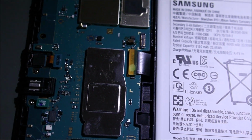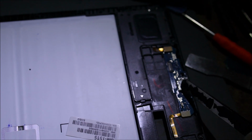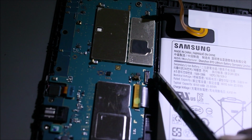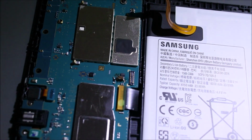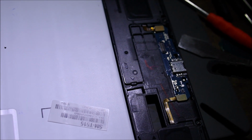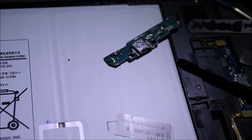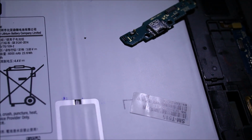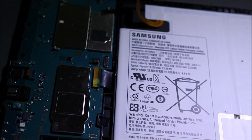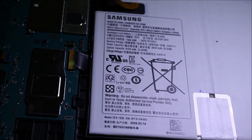Once the charge comes in here, then you have the connector here, you have the strip, the charge comes right here, and then this is the first cap it's going to meet. So therefore, if you have a problem with your charging port, something goes bad, and maybe some of the pins in the port touch together or something, it can cause one of the components to damage, right? It may not cause any component on this board to damage, but it can cause something on the main board. However, I'm going to put that on and then we're going to do a test.